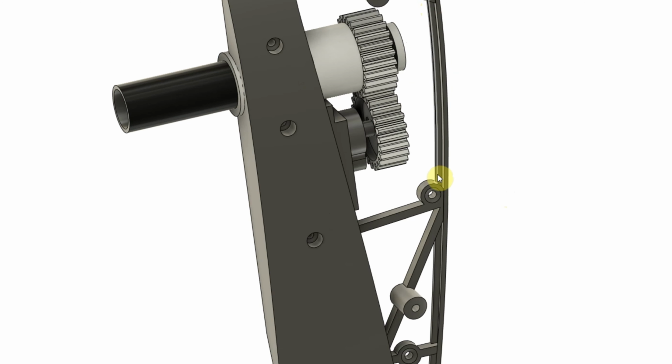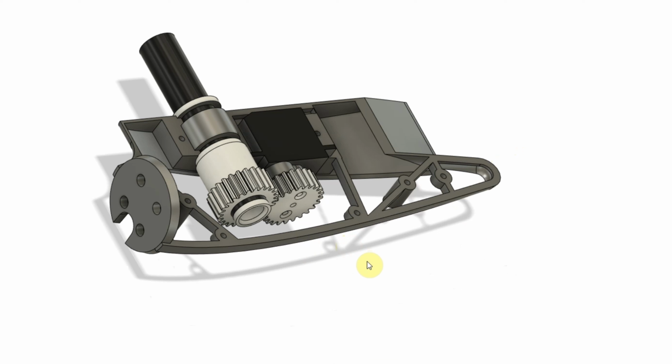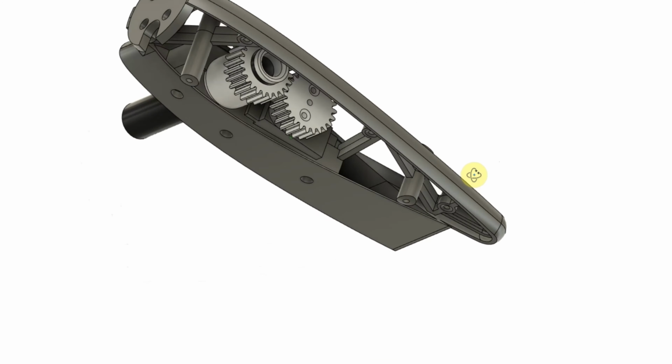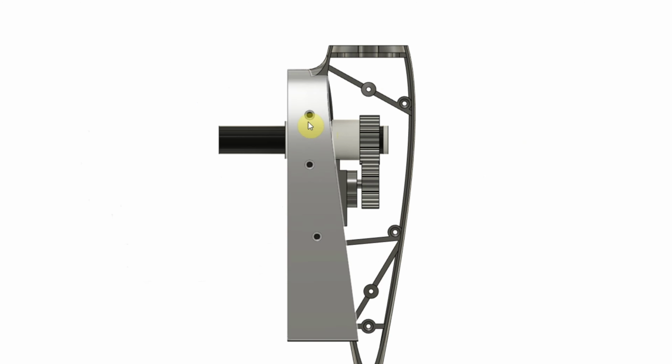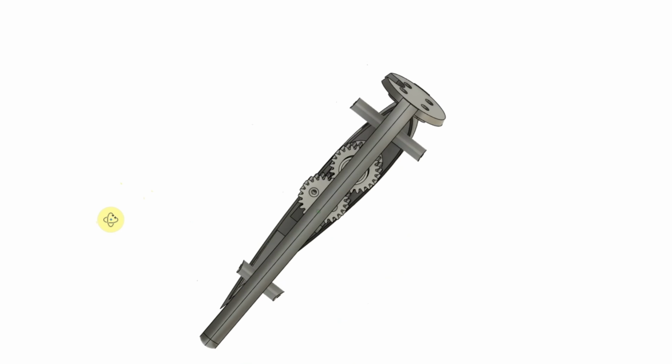The outside piece here has a flange, kind of a stiffener flange along it. By itself, it's very light, but not very strong. When we throw on the top section and screw them together, if you look here on the bottom, we've got two small screws, 10 millimeter long, 2 millimeter flathead screws, and they screw in on either side of the bearing, so that secures our pivot. And then this point down here, the screw really holds the back structure together.